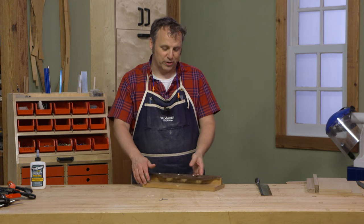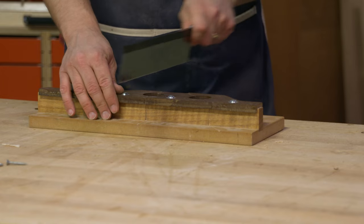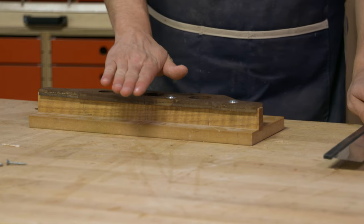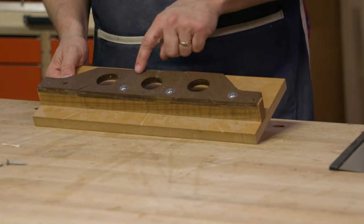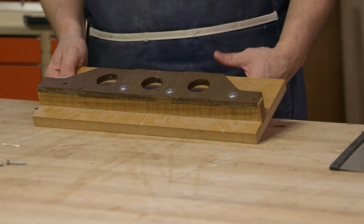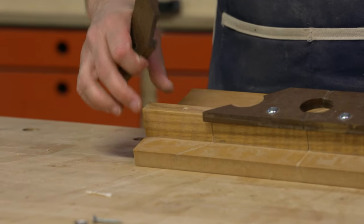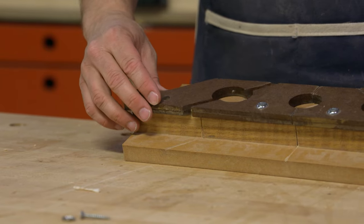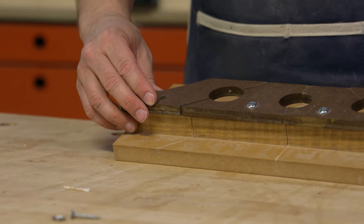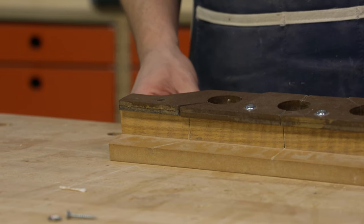The simplest way you could do it is to just flip it around so that your cutting direction is into the fence on the piece. What guides the saw are these four sections made out of hardboard. They have a groove on the backside that fits over a fence, and these oversized holes allow you to fine-tune the position so that it matches the thickness of the plate on your saw.